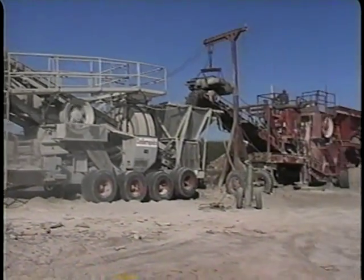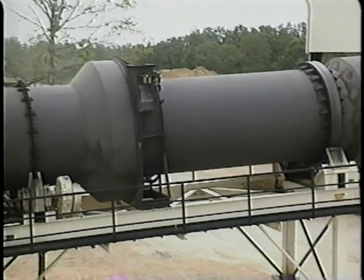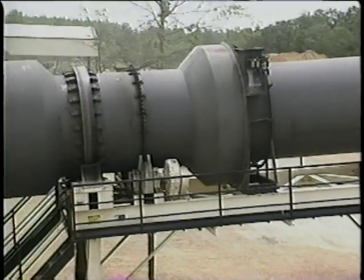If there were no air spaces in the overlay, the liquid asphalt would ooze up to the pavement surface on hot summer days. The liquid asphalt can cause vehicles to hydroplane over the road surface, and when the liquid asphalt hardens, it reduces the smoothness of the surface. With the planning, preparation, and production taken care of, it's time for placement.